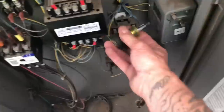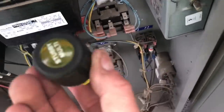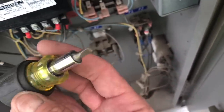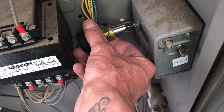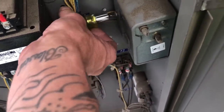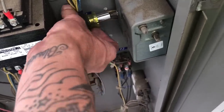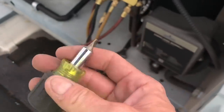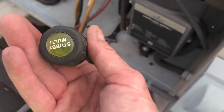Make sure you shut power off, especially anything — and I'm dealing with 460 here too. Get your little stubby screwdriver in here, this little Klein stubby, the multi-stubby. These things are awesome, especially for tight areas like this. It's the only thing you can get in here really. They're fairly short money too — I think they're only 10 or 12 bucks. You get everything: flathead, Phillips, different sizes on each end, and a quarter inch and 5/16 nut driver as well.